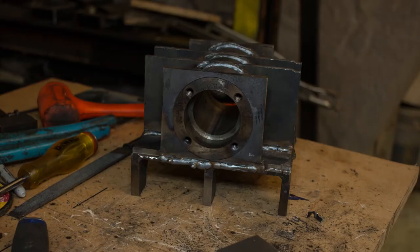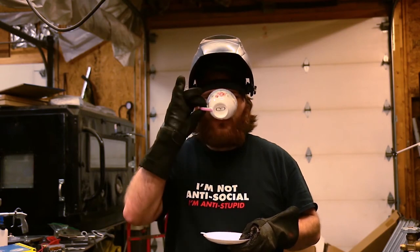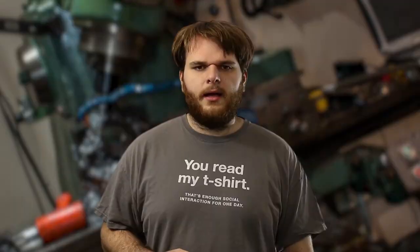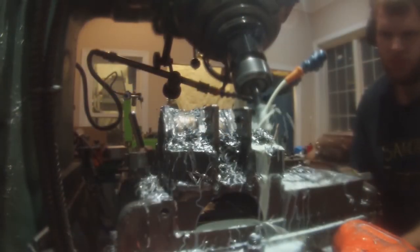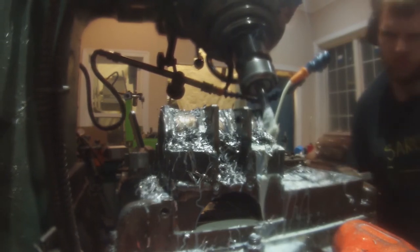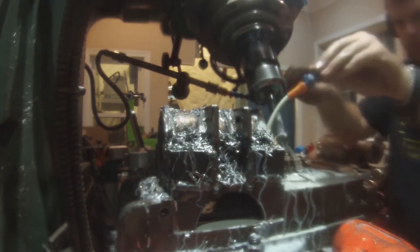But before that, how do we make this look better? What if we cut the sides at an angle? Now that right there is fancy. Not only fancy, but it saves weight — yeah, like that's a concern. The best way I could think of doing this was on the mill. I can rotate my mill head so that it is at an angle, and that's just what I did. Using the long 5⁄8 inch end mill that I got to mill the U-bolt slots, I slowly cut the sides off.